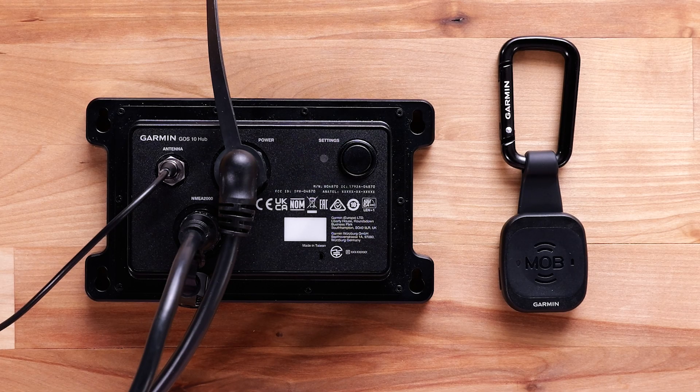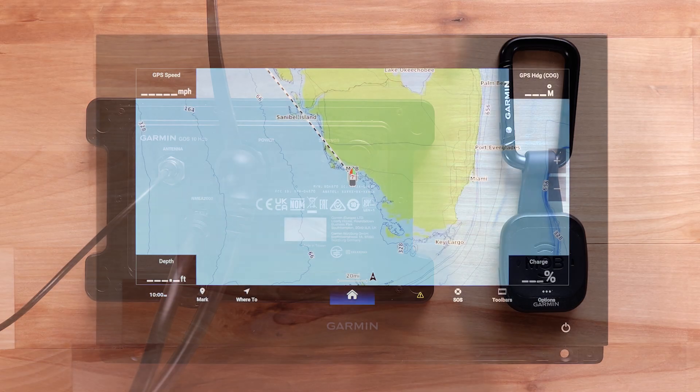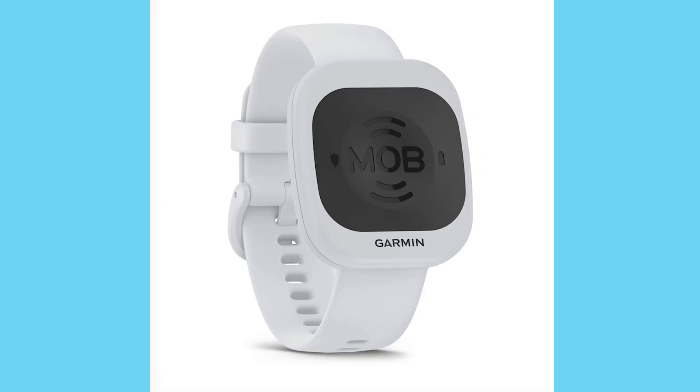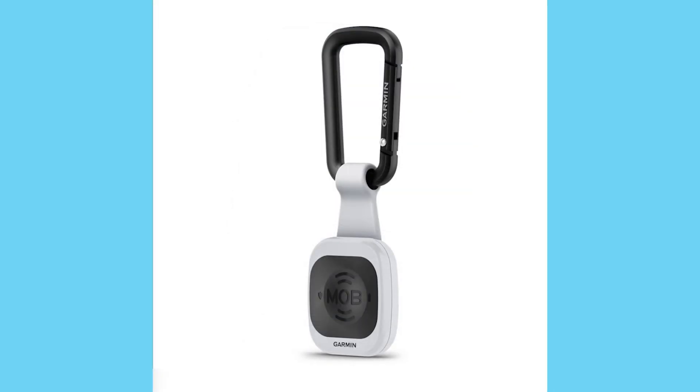For this process, you will need the Garmin onboard engine cutoff system installed on your boat engine or engines, MOB tags, and a compatible chart plotter to control the onboard system. For the best results, users should wear the MOB tag in a location that would likely be submerged during a man overboard event — for example, on the wrist, belt, or lower part of the life jacket. Wearing the tag on a shoulder may not activate the system.